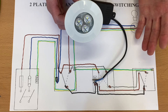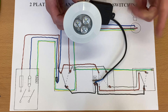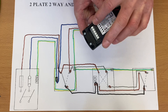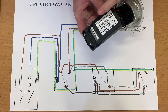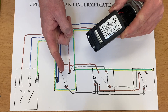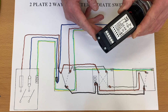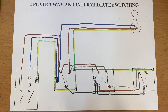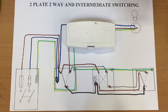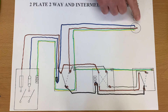What we've got here obviously is our LED downlights that we're probably replicating, and it's unlikely you'd have just one — say in a kitchen — so you'd have six, eight, whatever there is. You're going to need to add multiple lighting points. Remember, the connecting area could be on the LED downlight itself, which would have two switching lines, two CPCs, and two neutrals — bringing it in and going out to the next lighting point. The end lighting point would have one cable in it, but all the others have two. That section could also be a joint of some sort where the cables come into it.